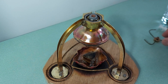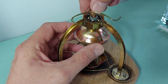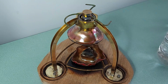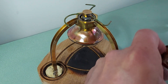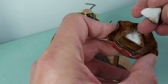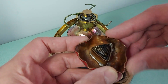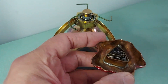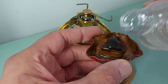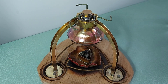Right, so we've got water in there. We'll put the top back on — there's a tiny little O-ring on there, though it's not surviving very well, getting a bit hot. Maybe I'll replace it with a soft copper washer. We put that in place and tighten it up carefully. Now for the ethanol — what we've got in here is cotton wool in a copper vessel with a mesh over the top. The mesh just protects it, otherwise you get fibers that burn off. We just fill it up with a good load of ethanol.